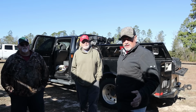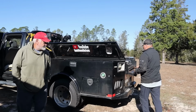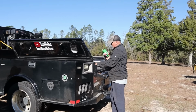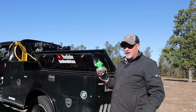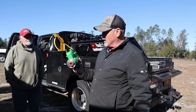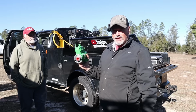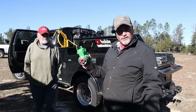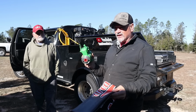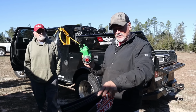One minute, 37 seconds later. So today we're going to get the fuel pump, finally come back from Area Diesel Service. So they rebuilt it. The problem with the pump was it had a cracked flex ring in it. And if you think about what the owner told me, he said that sometimes it acted like it would run out of fuel. Well, that's because that flex ring was cracked and it wouldn't allow the metering valve and all that stuff to stay in the correct position.